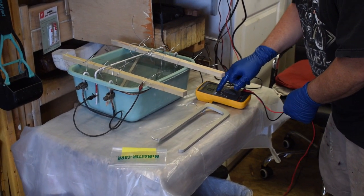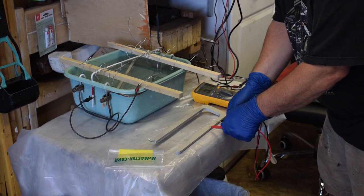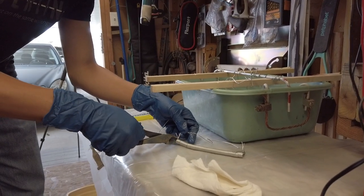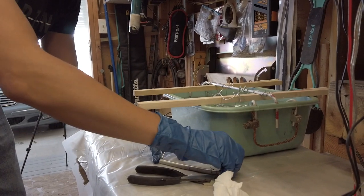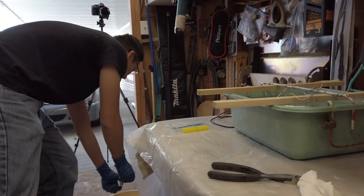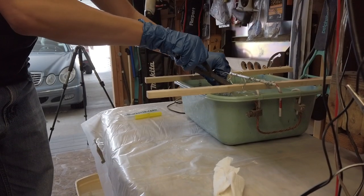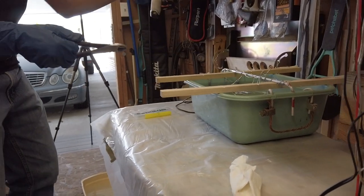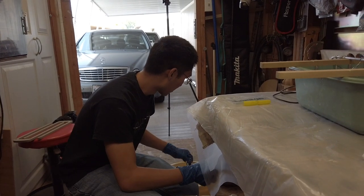When this is done on a commercial scale, your anodizing vendor has to dunk a rack into a large tank of acid regardless of whether you're making one longboard or ten. So unless you know a guy, electroplating shops typically charge a minimum fee — anywhere from $100 plus or minus $50. We paid $135 to have our longboard parts anodized and would have paid something pretty close for just one board. Anodizing scales really well if you're producing things in quantity, but the value proposition is a lot worse if you're only doing a few parts.